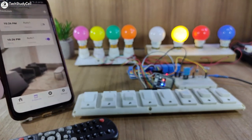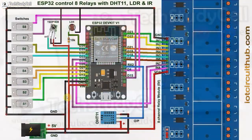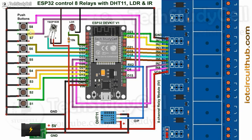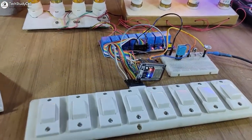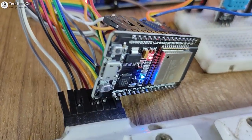So now without any further delay, let's make this project. This is the circuit for this project. I have given the 5-volt supply to the ESP32, relay module, and the sensors. These switches are connected across the GPIO pins and the ground pins. If you want to use a push-button, you just have to connect the push-buttons across the GPIO pins and the ground pins. Please take proper safety precautions while connecting these appliances with the relay module. As you can see, the circuits are very simple and you can easily make it.